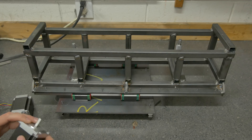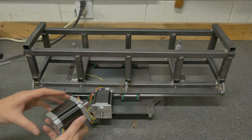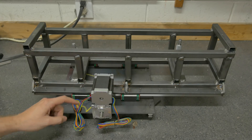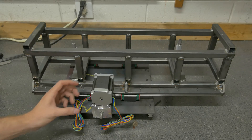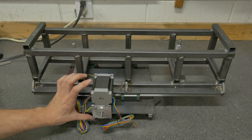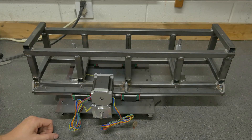So here's kind of what I'm thinking. We could mount one here, and that would be belt driven to the Y axis. And this could sit right on top, and the rack gear would go this way mounted here. The only thing I don't like about this is it sticks out in front of the machine a little too far, and having this much kind of cantilevered off of this, I'm not really happy with. We could beef it up and it would work, but not ideal.